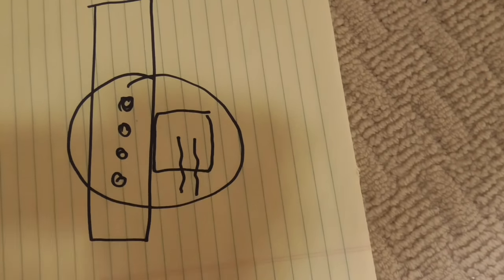So what you have now is all these holes in the ceiling, and since this is 5/8 inch thick drywall, 5/8 of an inch thick, it's pretty darn thick. It's even thicker. So you've got a lot of room here. After this hole was drilled and this hole was drilled, we took a scoring knife, you could use a screwdriver or whatever knife you want, and just cut out or gouged out 5/8 of an inch of the ceiling, until we were able to see the stud.